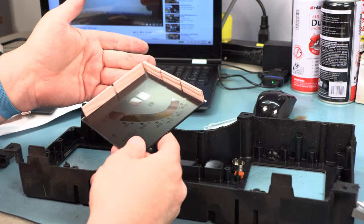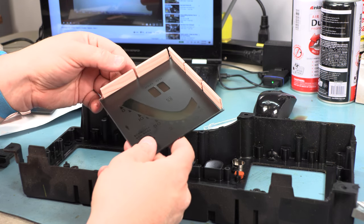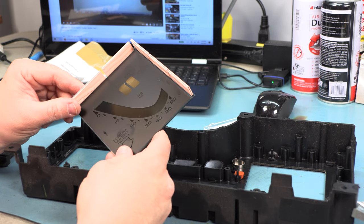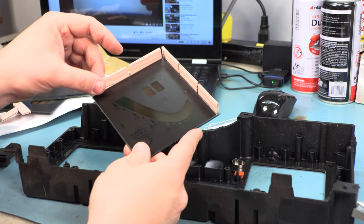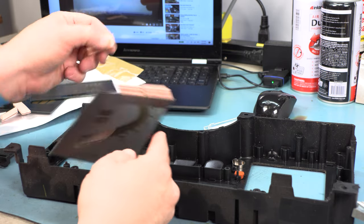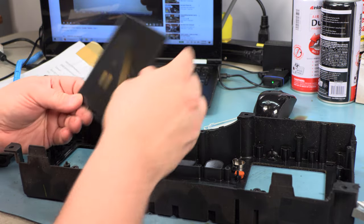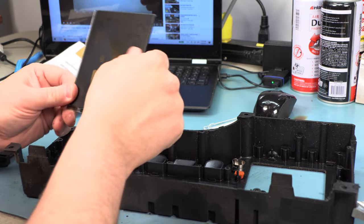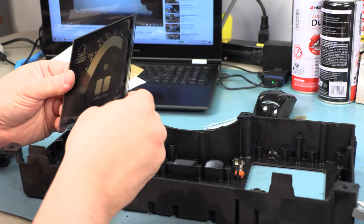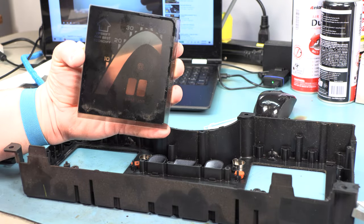People ask me how I remove the elastomeric connectors. These are not glued in any way, shape, or form — the adhesion is caused purely by time. To remove them, I just slowly peel them away from the glass. Again, no peeling of the back film. We do see some paint wear that will need to be retouched, no cracks, and just a huge amount of Armor All. Anyway, this is a restorable panel.